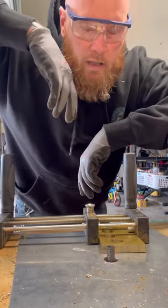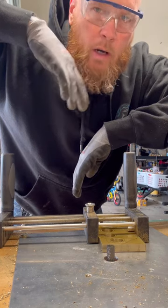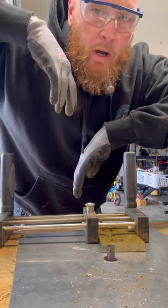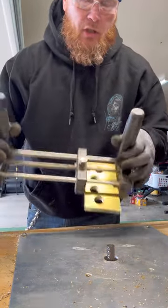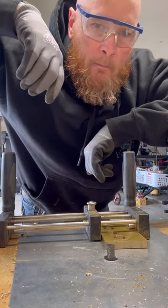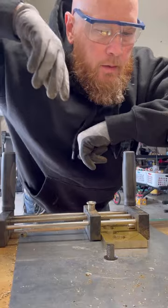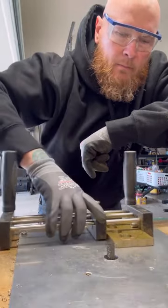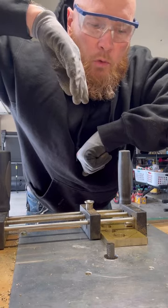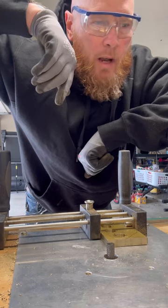Okay, so the next part of this process is ovaling out the holes. And I do that before I cut out the shape because I want to be able to get a pretty good hold on the piece of brass with the jig. Now, I use this jig. I'll tell you that for months, I would just use my hands. I've got a DeWalt 616 router mounted under this table to this piece of aluminum. And it's something I rigged up based off of a router table used for wood because you don't see a lot of people sharing information on how to make things out of brass.